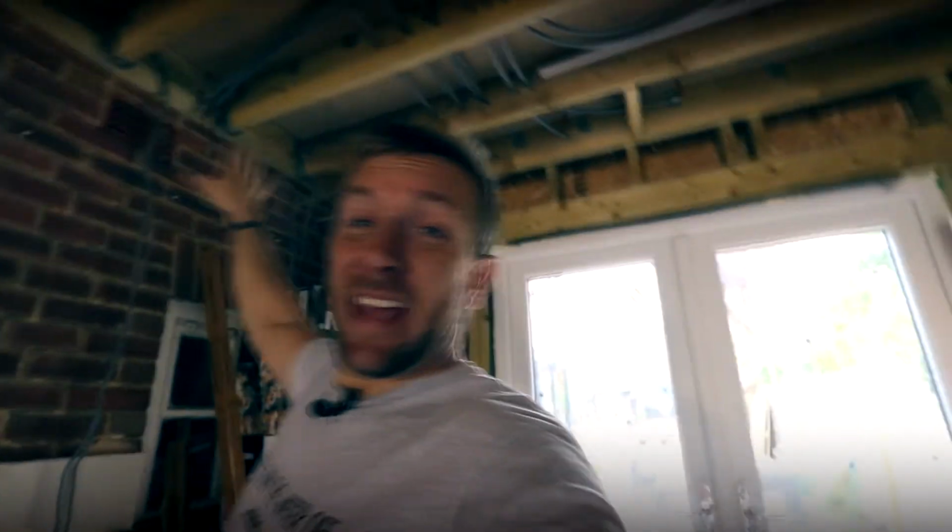So then guys, time for a couple of explanations as to why we've done certain things on this job. Number one, we've got some pipes on here. These pipes are gonna get clipped back, okay, just like the ones up there. You might be wondering, why has he not just put some elbows there going across to his hot and colds? That's purely because I just wanna keep the flow rate up. So yeah, that's the same for this bit here. So you see they just sweep across there. All our pipes will be insulated, so there won't be any problems with them touching the wires. And it's the same for what we've got going over to here.